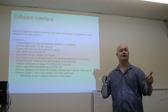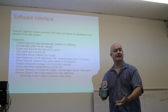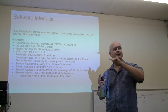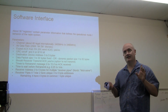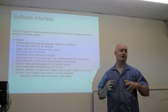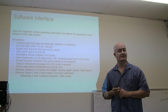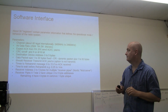And they have a way of selecting, like you might have 3 channels that you're going to try to use in your link, and if you transmit and don't get a response back, you switch to channel B and you transmit, and the receiver all the while is quickly rotating through its 3 channels looking for a broadcast. As I understand it, that would be the method for handling multi-channel with this frequency agility protocol. Overall, I've stuck with 1 channel, and a product I sell is a single channel, and the FCC approval is done on a fixed frequency. Could get you into trouble in some environments, but for now it seems to work fairly well.